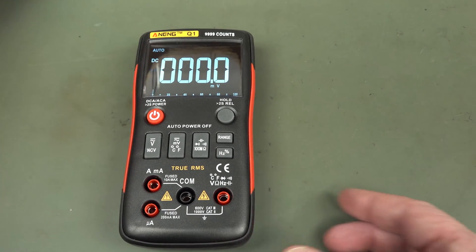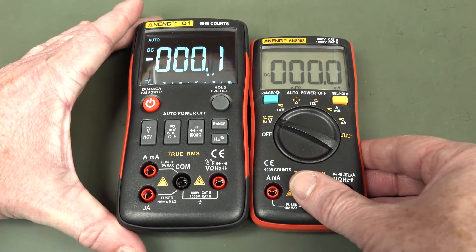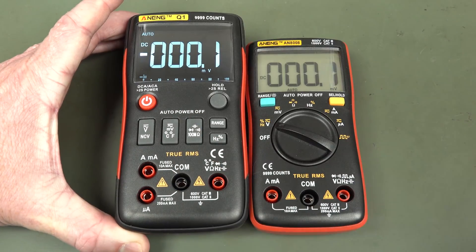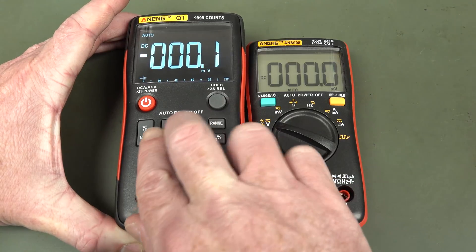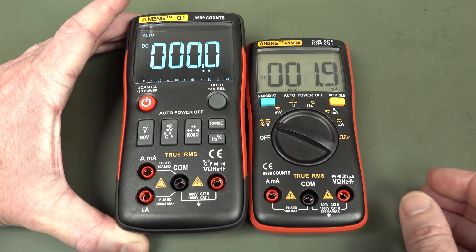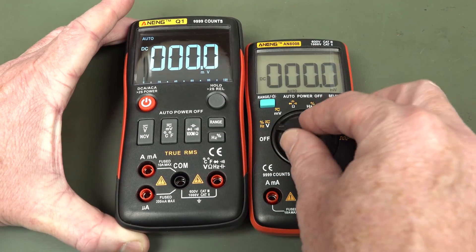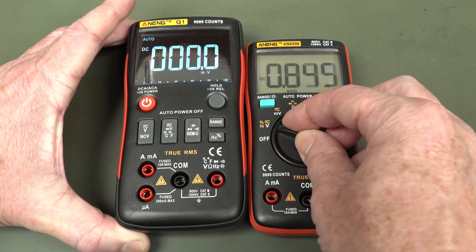Let's take a look at it. There are two immediate differences I'll cover in comparisons with the 8008 as we go on. The first is that it's all push button, and a lot of people ask why they don't make multimeters with soft push buttons instead of the range switches we're so used to. Well, the reason is it's easier, cheaper, simpler, and more reliable to get isolation on the various ranges when you use a multi-ganged mechanical switch.